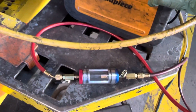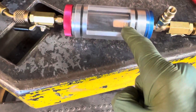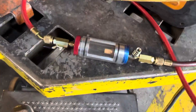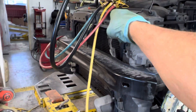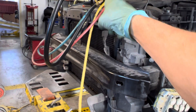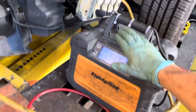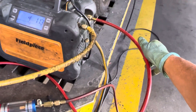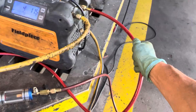This unit has a condenser inside it, just like the condenser on a car, that turns vapor to a liquid. As you can see, all the green dye I had in here is gone, and all the oil is gone. Because I took out a clean vapor with no oil in it, condensed it down into a liquid, and now I have clean, dry, fresh, pure refrigerant as a liquid.